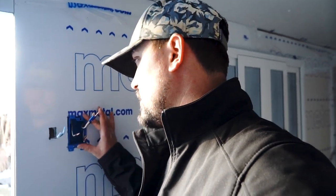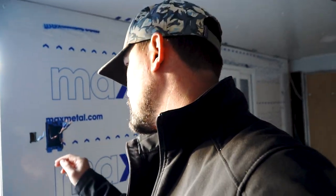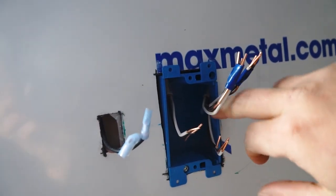I wanted to show you guys this because I wish I would have found these before I installed all my boxes. Up here I'm putting in a double toggle switch to control my exterior lights and interior lights. I originally had planned on a three-toggle switch for the exhaust fan, but that actually came with its own dial for the light and fan on low and high settings, so I'm going to wire that with straight power to it. With four wires coming in, the shallow box made it almost impossible to get a double toggle switch in there. But this replacement box is almost like a double box with wires tucked in back.